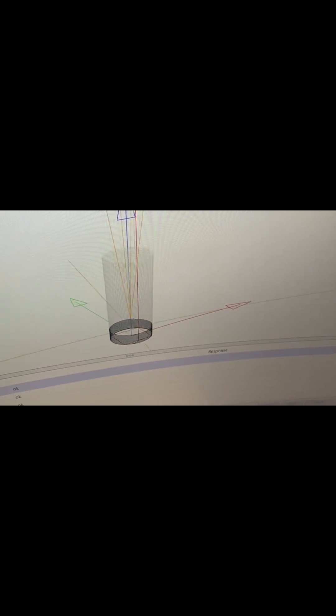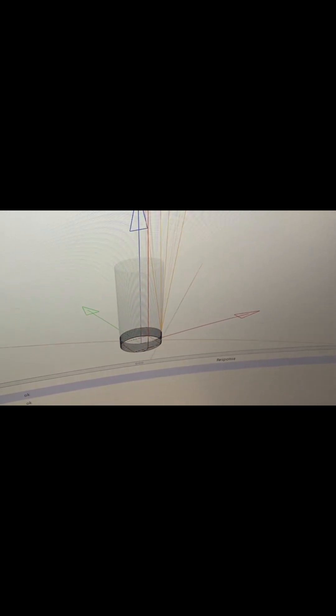It's doing a five-degree cut now, a little faster — I don't think I'd go any steeper than that. It's orbiting a 7.5mm orbit around a 6.3mm pin, which is a quarter inch. It'll take about three minutes to do this 6mm trim. Here you can see the output to the mill.